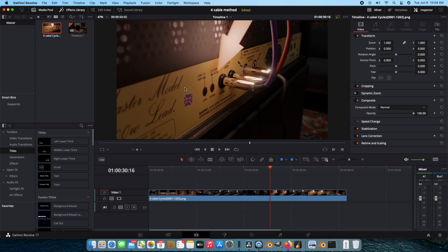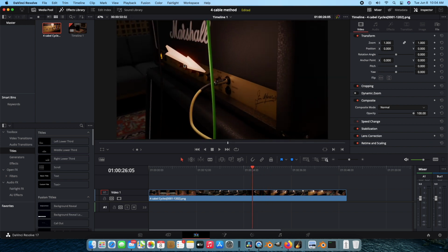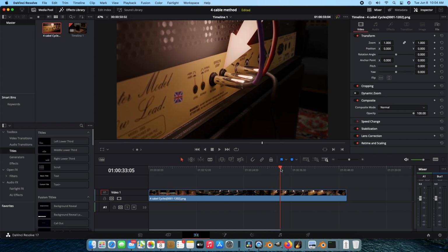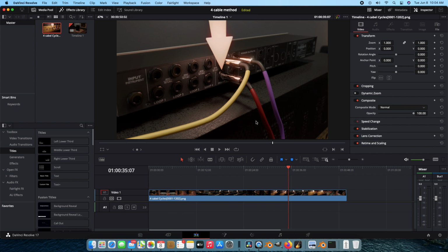So there's a break in your signal chain at the effects loop. When you play your guitar and you set up your EQ, your gain structure and all that, and you get the tone you want, that signal is then broken and sent out the effects loop. Now the effects loop, I believe, drops the impedance down again to mimic what it would be like going into a guitar pedal from a guitar, a low impedance signal. That signal is then brought back to the return of your processor.